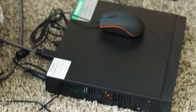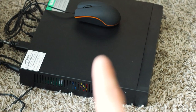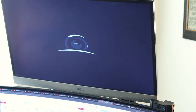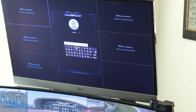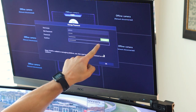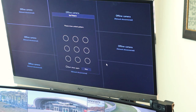I decided to set up the NVR in my office — not the permanent location, but just for setup. Go ahead and plug in the HDMI or VGA cable into your monitor, plug in the mouse, and plug in the power. The NVR should automatically turn on and boot up. Go ahead and select your language and press OK. The initial admin password will be 123456 — now go ahead and create your own password. You need a strong password to progress. Now set your pattern password, which you'll be using quite often with the NVR.